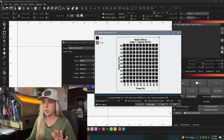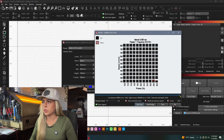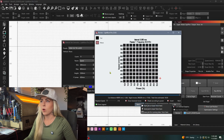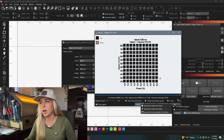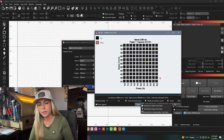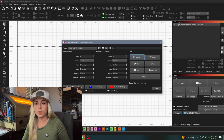Let's exit out and go to Preview — here we have a preview of our material test. Once you get it in the general area you want, use your arrow keys to fine-tune the position because sometimes the mouse won't work precisely enough. When you're ready to start the cut, come over here to Start Here and select Start Job on Laser From Here. That way you don't waste your work — you can start exactly where you need it. That's why it's so important to always start with lower power.